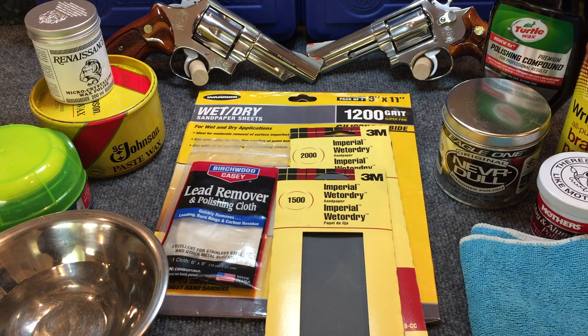In order to get that clear bright finish, you have to understand the difference between polishing and shining. Shining metal only creates that metal's ability to reflect light. Polishing smooths the surface of the metal and increases its ability to shine and reflect light. If you just shine something, eventually it will go back to its dulled state. If you polish it, it'll never go back to its dulled state, though you will from time to time need to polish it again just to remove any future fine scratches.